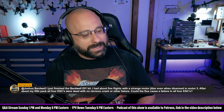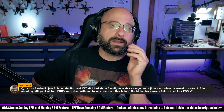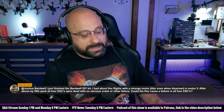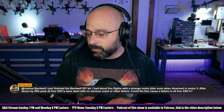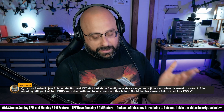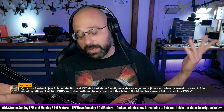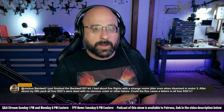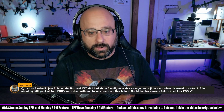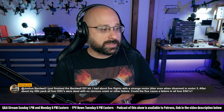Could the flux cause a failure in all four ESCs? I mean, if you're using acidic flux instead of no-clean flux, yeah — that may not be the answer you want to hear. I have seen cases where acidic flux caused shorts and smoke. I always use no-clean flux and I've never had this issue, but I was working in somebody else's shop and they had bottles of regular flux. I was just using it like I always do, just glob it on there. Sometimes when I would plug the quadcopter in the very first time after finishing the build — poof — we'd get this big poof of smoke. It didn't damage anything as far as I could tell, but I think it was the flux burning off. So if you were using large amounts of regular acidic flux instead of no-clean flux, it's plausible that the flux would cause a failure.